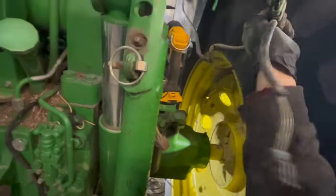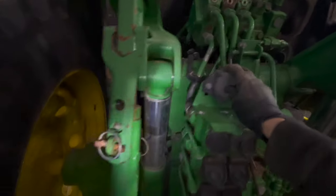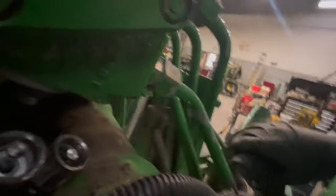There's this pigtail here that comes off — it's got three wire connectors on it. One of them goes up to here and then down for your three-point, and the third one comes down right in there and hooks up to the three-point hitch position sensor. We have to take this off because it's connected directly to the top wiring harness, so we can't disconnect it in here. We just take this whole plug off and it'll stay up with the cab.